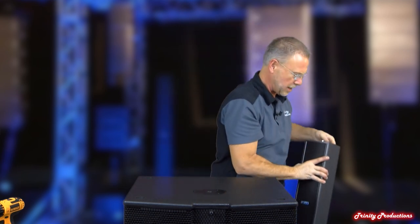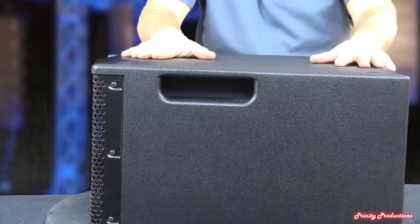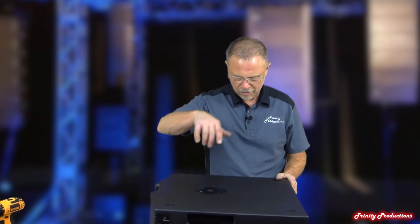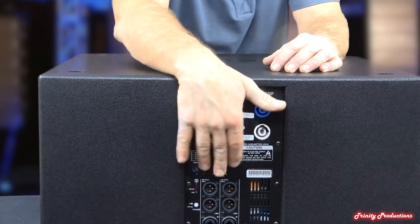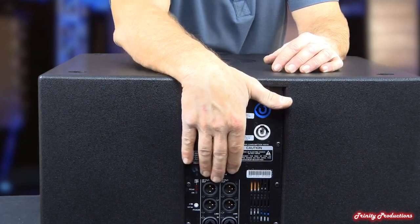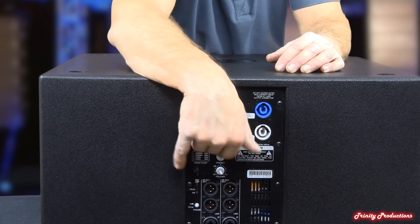So we've already gone over the specs of the sub — here it is with the two eight-inch drivers. Spinning it around, it's got a couple of handles on the sides and is wood construction. It has an M20 socket in the top for pole mounting. On the back you've got all the connections: PowerCon in, PowerCon out, input, DSP settings, XLR inputs, link outputs, and high-pass filter outputs, so it handles all of the crossover by itself. Settings include the crossover for full range or what they call punch — and I can tell you the punch works very, very well.